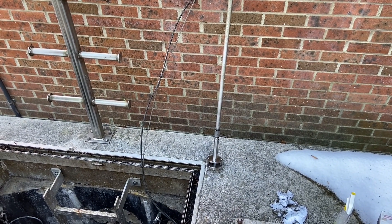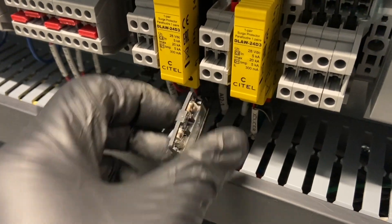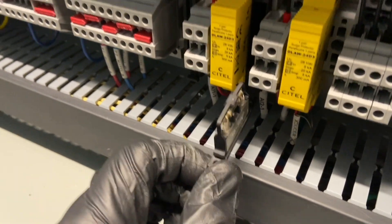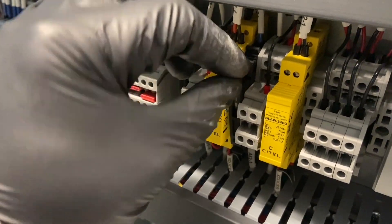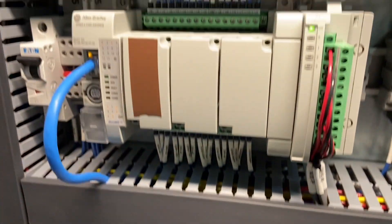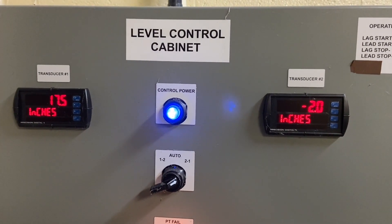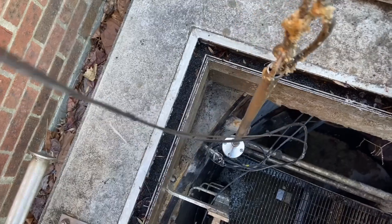Got the new one attached, but before we put it back in the well, I want to replace the fuse and turn it on to see what it reads. It should be about 0, because when it's out of the water it's at atmospheric pressure. 0 PSI, 4 milliamps, 0 inches — looks like our signal splitter's happy again. Pretty lame computer 2, pretty lame computer 1. Now let's check the display. Negative 2 — not perfect, but at least it didn't short out this time.